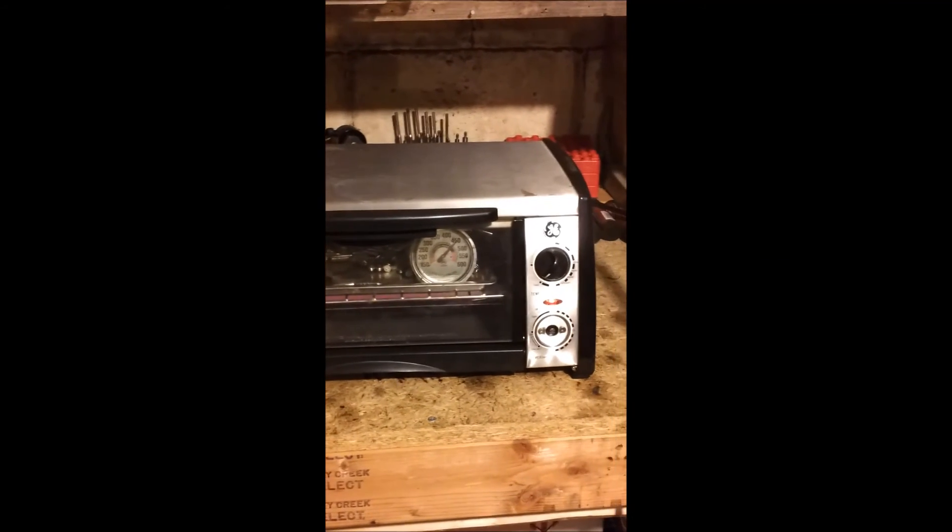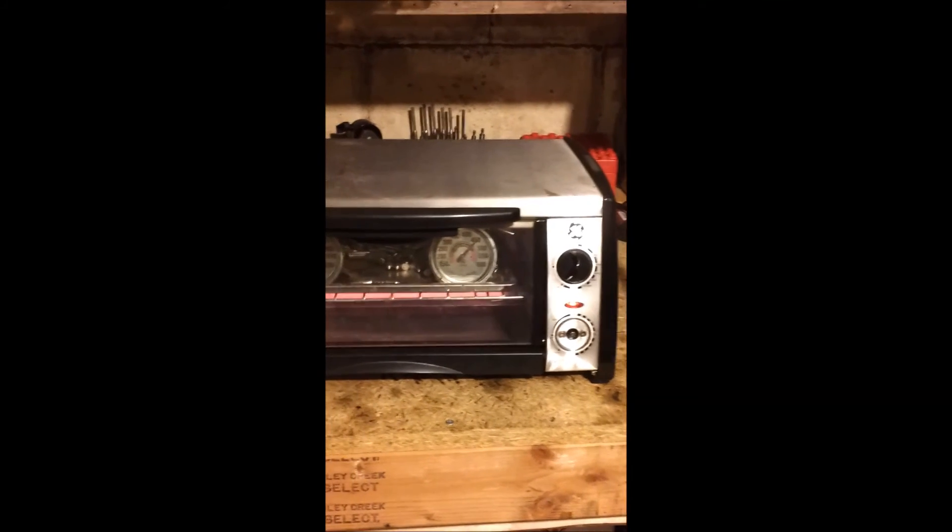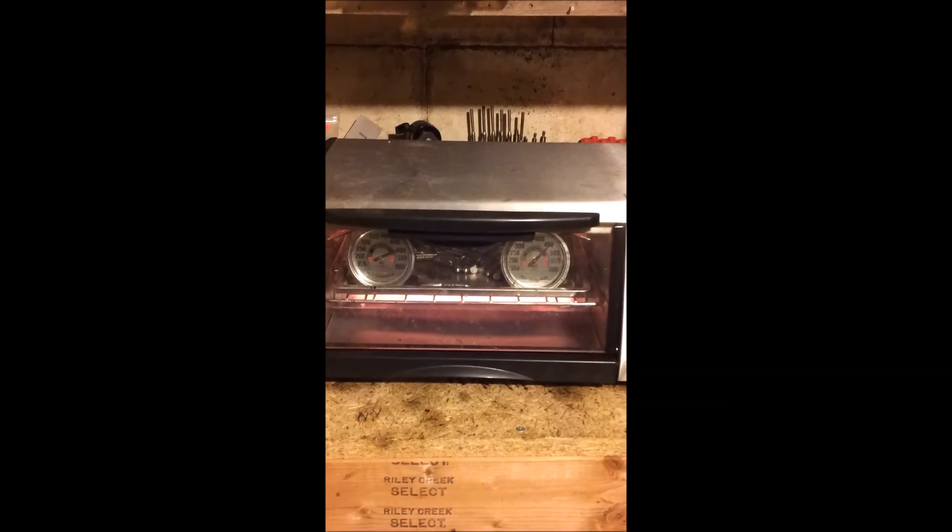That's a 75 pound slab, and then the other three are 80 pound slabs. And then I broke one up and made all those ingots out of that. But I don't use that much now that I learned how to heat treat. So I just use the wheel weights and I heat treat them, and I get 30 Brinell hardness out of it. So that covers the rifle and the high pressure pistol. And there's my heat treating toaster oven — doesn't do a whole lot at a time, but that's all I do anyway. Probably another 20 minutes and these will be done.